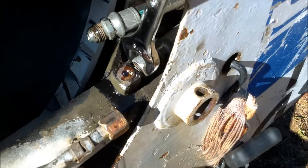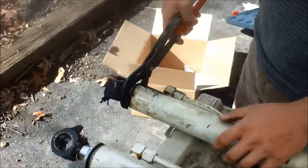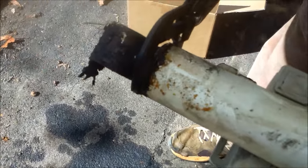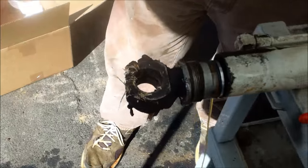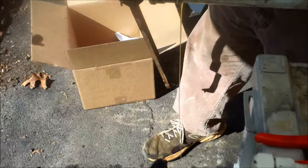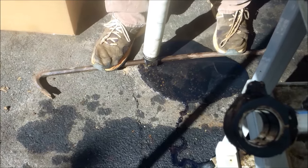These look like replacement hoses — they're not the original ones anyway. Right now I'm loosening the main nut that keeps all the dirt and grease out of it. You can use channel locks; they also make a special tool that fits into the holes. Just take it and rotate it — it's threaded in there pretty good. It's aluminum so you want to be careful. It's best to do this outside or over a catchment system. We're going to put a crowbar in here — there's a lot of fluid, so we'll put sawdust down.